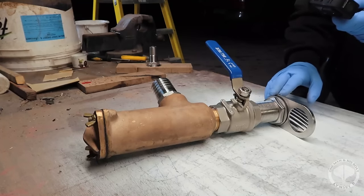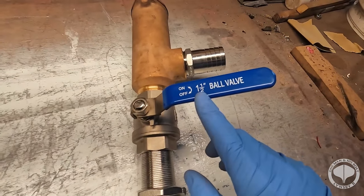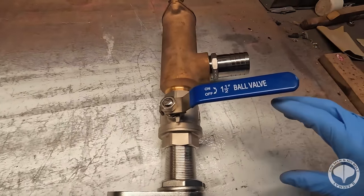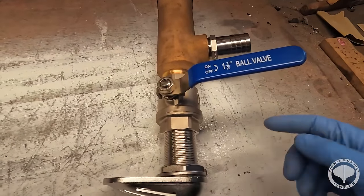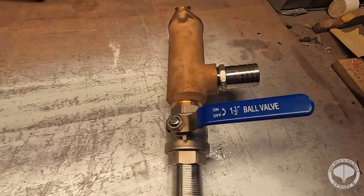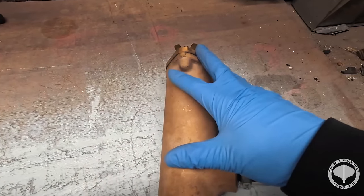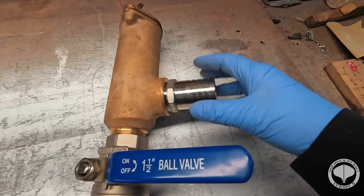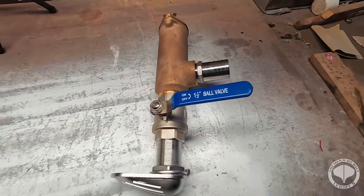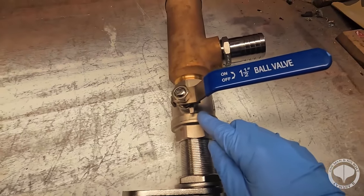We have our scoop, which we've already seen. Now we have our on-off ball valve. There are different types — this is a ball valve, which I like because it's just one swift movement and the water is completely shut off. Other types twist with a little round handle and slowly push the valve in, which takes a long time to stop the flow of water. Then we have our strainer, and then the outlet, which goes to your engine, pump, or wherever you need it. So let's talk about the ball valve next.